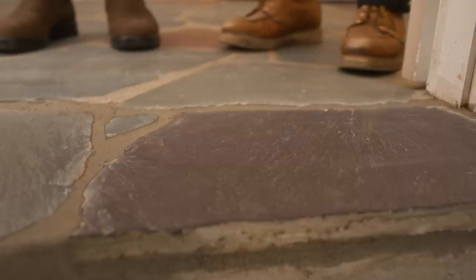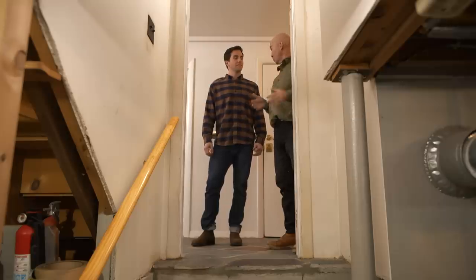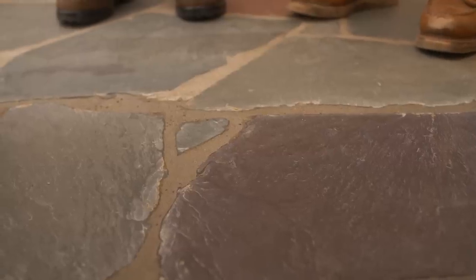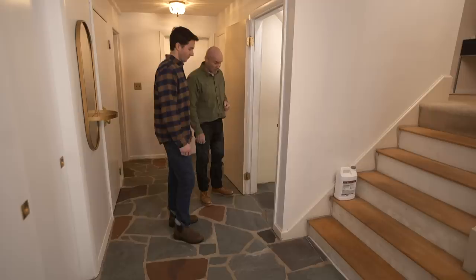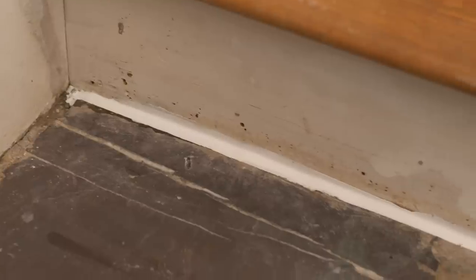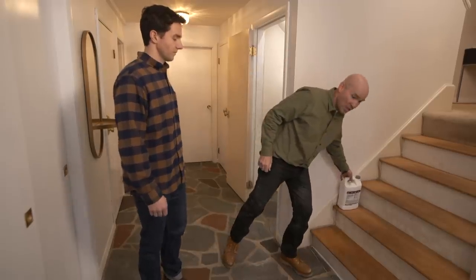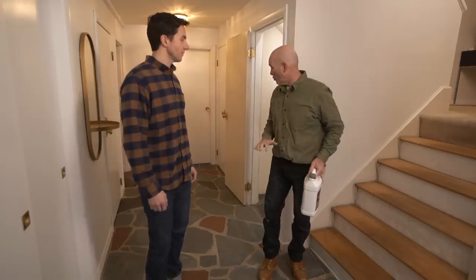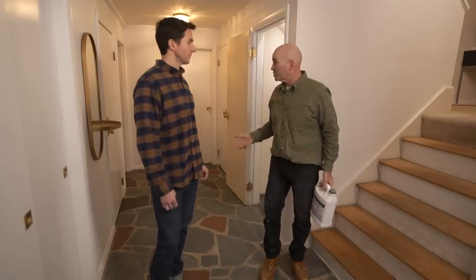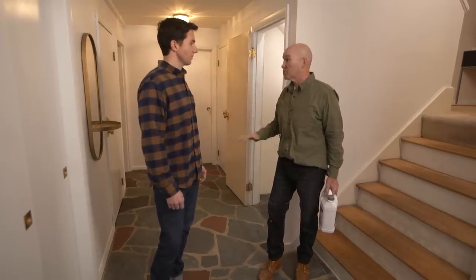What do you think? It looks beautiful. I'm happy with it as well. All I ask is that you wait 28 days for this to cure. This is a perfect temperature for curing, so we're going to be good. You can see that we're a little dark right now — that's only because we're wet, but once that starts to dry out, you'll see that it matches the floor just great. And over here the caulking joint, the goal was just to roll it up a little bit so when you paint that riser white, everything blends in seamlessly. And the last bit of homework you have is this masonry sealer — it's actually a luster, so it'll make the entire floor, the stone, and the joints brighten up and have a shine to them. That's also going to help take this patch into the room and make everything look seamless.